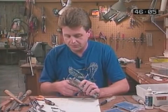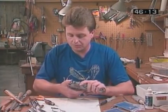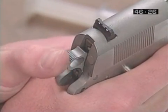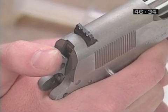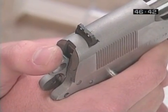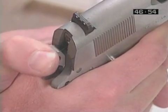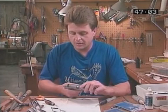The next thing I usually like to check is to see if your hammer drops into the sear at half cock. If it doesn't drop in all the way, right there is where it catches it. If you lower it in there slow and feel it binding on the sear, sometimes if you don't have enough take-up in it, it'll bind going up into it. It'll actually wedge itself into the half cock notch. Now this one drops straight in, real positive. That's usually a good indication of having enough take-up in your trigger pull, and that'll give you a good place to start.